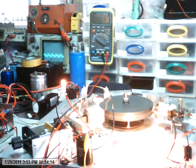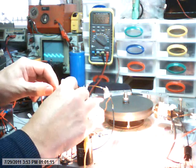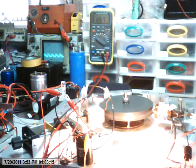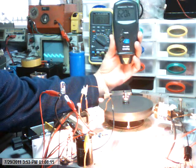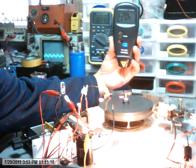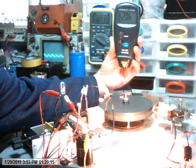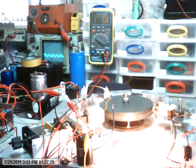Switching now to a lower load — specifically a tilt circuit with a 6-ohm resistor. The load now is about 300 milliamps. RPM has risen slightly to 4,024 RPM at 1.864 volts.